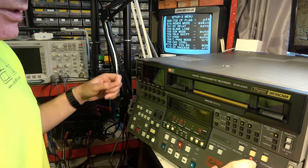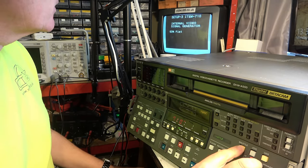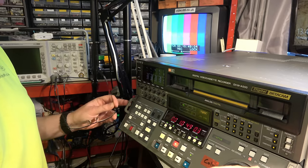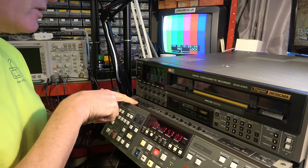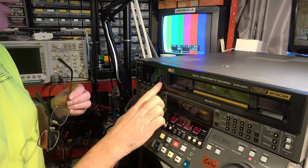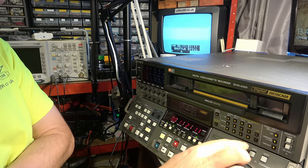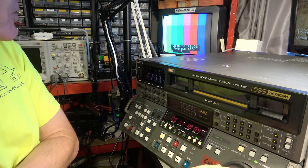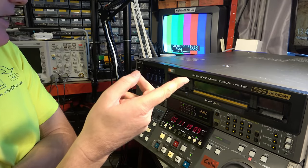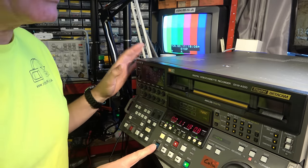Operating hours are quite high - it looks like it's been in standby a lot. Drum hours: 2,000, and the resettable drum hours are the same, so it's only run about 2,000 hours of tape ever and it's still on the original heads. I'll put in a brand new tape and make a recording using the built-in color bar generator. Going into the menu for the internal video signal generator - changing to 75% color bars. I'm now making a test recording.